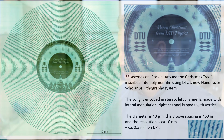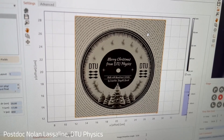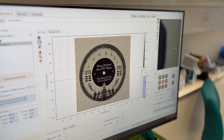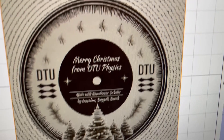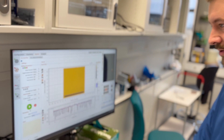Today we're going to pattern the world's smallest Christmas record. What you see here is an image of the pattern we're going to do, where basically we have some grooves which are Christmas music recorded in stereo. The wiggle of the groove is one channel and the depth of the groove, given by this grayscale color map, is the other channel. This is our artistic inner part of the record, and this color map represents the height we're carving into the surface. The whole thing is about 15 by 15 micrometers, with a depth of about 65 nanometers — so small that the entire pattern could fit within one single groove of a regular vinyl record.